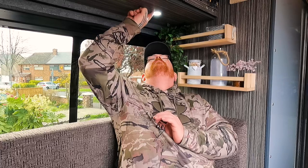What these do is when you touch them the light comes on, very similar to the ones up there. Touch them, light comes on. Touch and hold your finger on them and the light dims. So touch: light comes on, touch again: light goes off, touch and hold: the lights should dim. They work by decreasing the voltage — when you touch it, it decreases the voltage so the lamp goes dimmer.